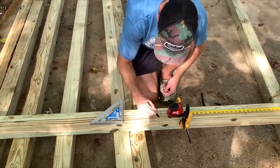Next up, you wanna make sure that you don't have any screws or nails that are sticking up that are gonna impact the application of epoxy. So use a putty knife to see if anything is protruding up, and if it is, go ahead and use a drill or a hammer to make sure that you sink it below the plywood subfloor deck. Repeat this process over the whole shed plywood subfloor area. Finally, I grabbed the vacuum and I vacuumed the entire shed subfloor.